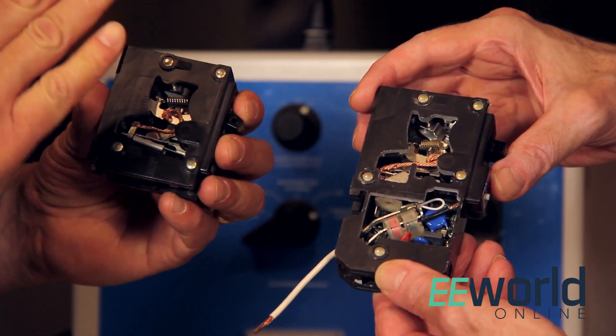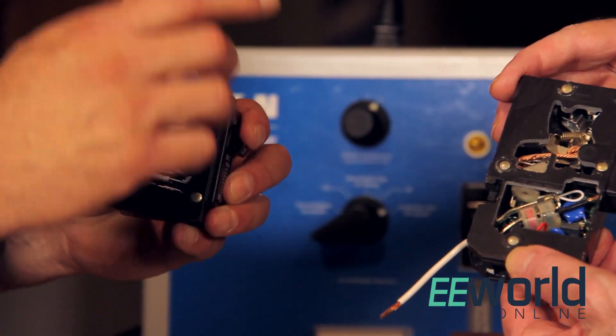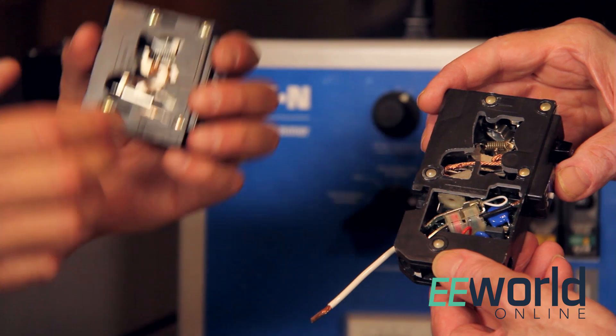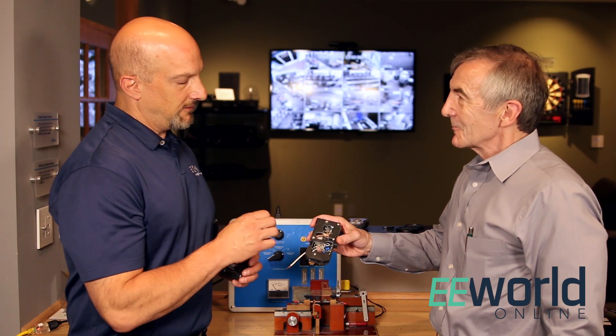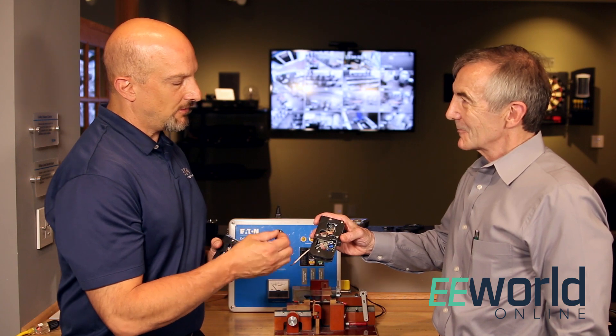The thermomagnetic breaker detects just high currents. If I have 10,000 amps, it's going to trip almost instantly. If you have an overload — your microwave and hair dryer and everything plugged in pulling too much — it'll trip over several hundred seconds. But what happens with an arc is it reduces the current a little bit — it actually takes away from the current because of that resistance.